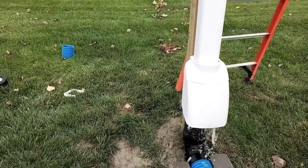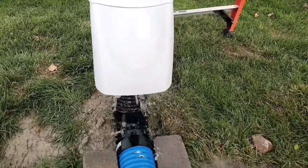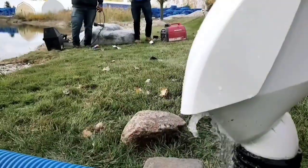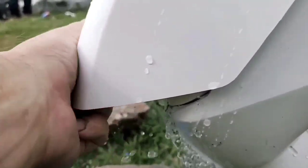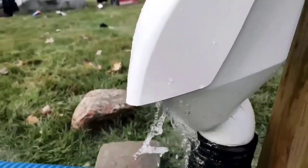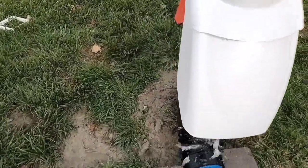Here's one that's for rainwater harvesting, and it has a screen to filter out mosquito larvae and really small, fine particles. You have to clean this screen regularly — you have to be vigilant because it's such a fine screen. I've seen pollen and what I refer to as a biofilm collect on these in no time. If you're harvesting water to drink and you're going to be running all kinds of filters and cleaning the screen all the time, that's probably where this is going to be at its best — that's really what this was built for, in my opinion.